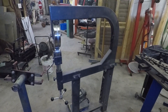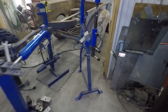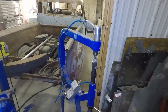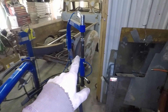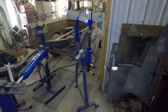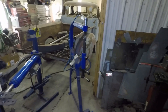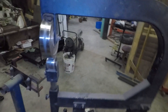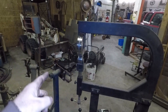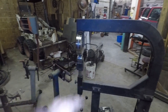Here's your typical English wheel. That one's a Harbor Freight because our Princess Auto didn't have those at the time. And then I got a planishing hammer — those things rock. If you had to have a choice between that or an English wheel, if you're starting sheet metal, I would say go with a planishing hammer. You'll see way more rewards faster working metal, and you'll get a better feel. I think it's actually faster than a lot of the pneumatic stuff, but you've got to hand bash your tin first, and then just use it to smooth out all the wrinkles and bends and dings you put in the steel.